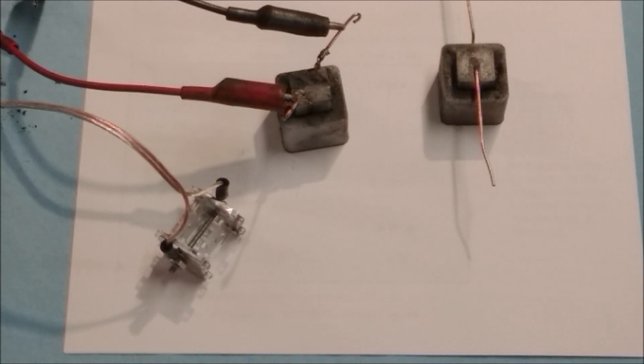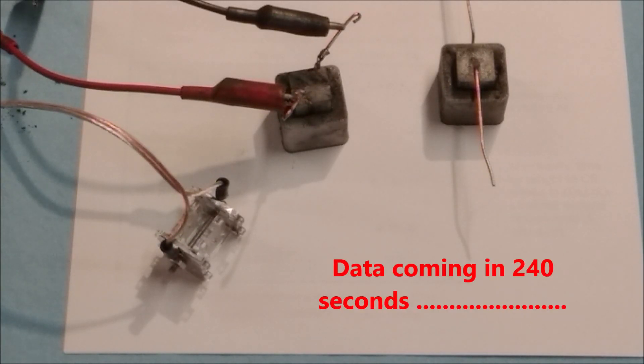In those videos we tried a couple of different carbons — one labeled at least 5 micron flake graphite, and another of unknown size and conductivity. In my shop here I gathered up three more carbons: an activated carbon run through a coffee grinder to pulverize it, that same activated carbon after extensive ball milling to really powder it up fine, and some carbon black.